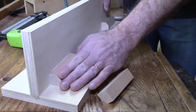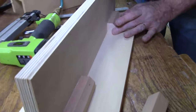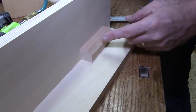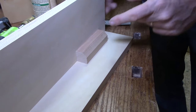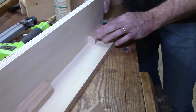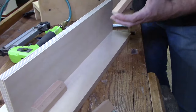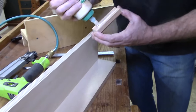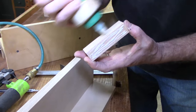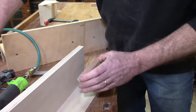Oh, good question. Madison, I do that because it's kind of a throwback to history, like that's the way they always were. But also, if you're going to clamp those down, if you have a hard corner, it's harder to get the clamp on with a stable edge. And in this case, I want to nail it so it gives me a good flat surface. And it's just a little nicer on the jig over time to have a softer corner there. So it's really only for those reasons. Doesn't change the effectiveness of the block.